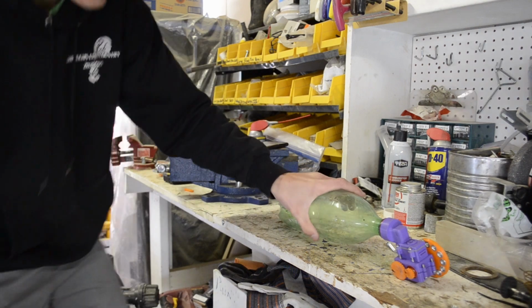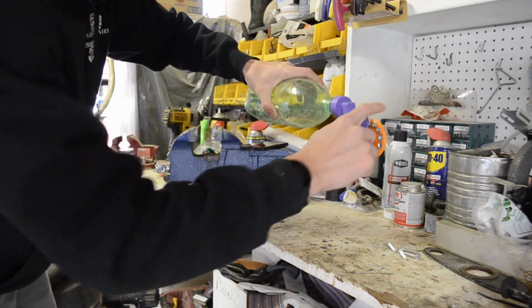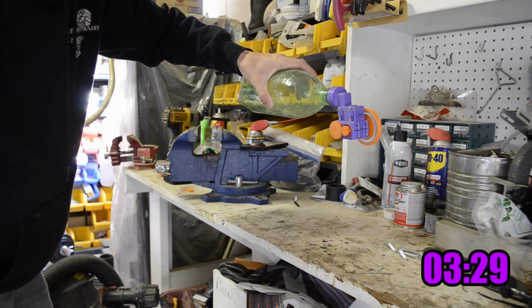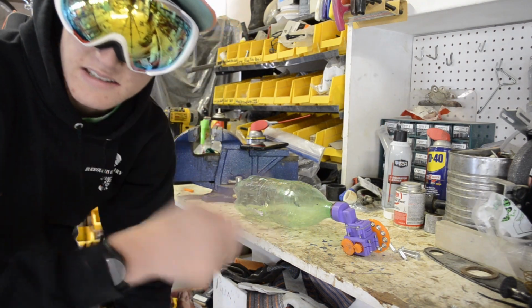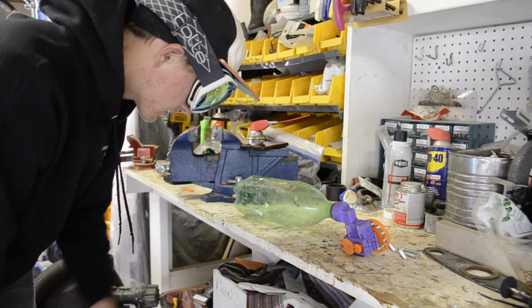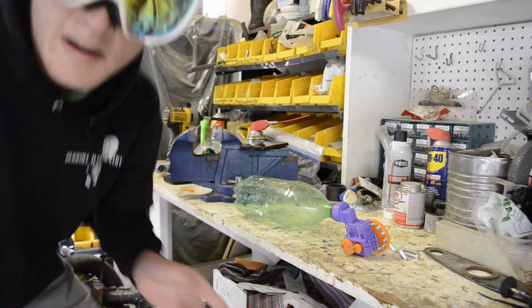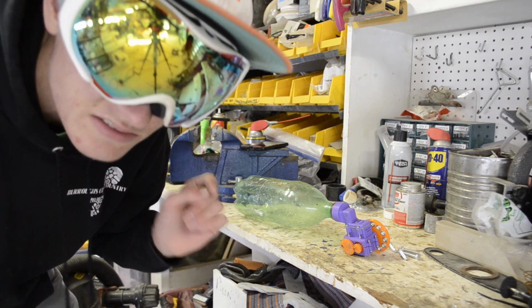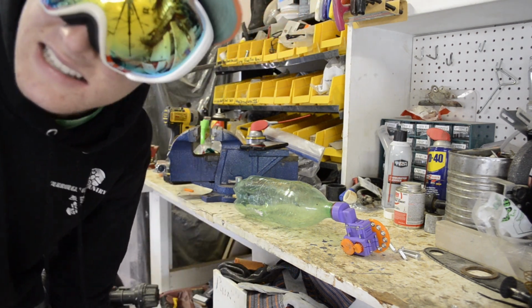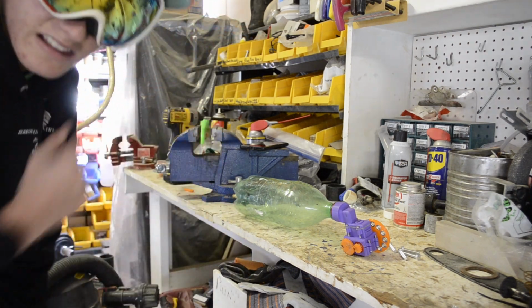That is 40 PSI. Here we go. I don't know what it was. Timestamp's down there, but I'm assuming it's like, what, 7.5-ish seconds? Somewhere around there. But I'm actually gonna go grab the tachometer and see how high it's really revving if it's running out of air that quickly. Because this is less leaky, actually, than the last engine.